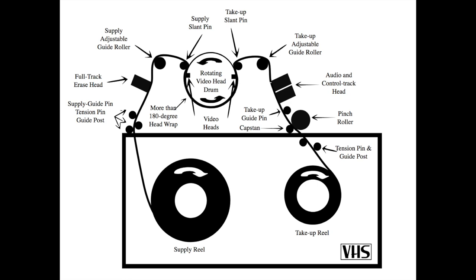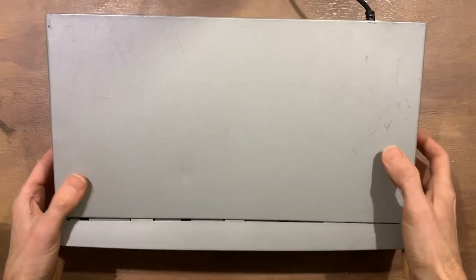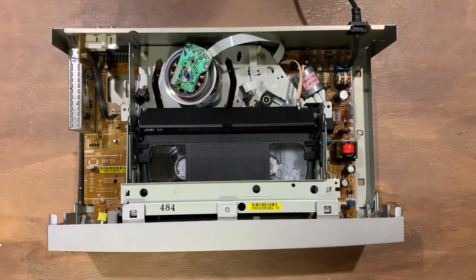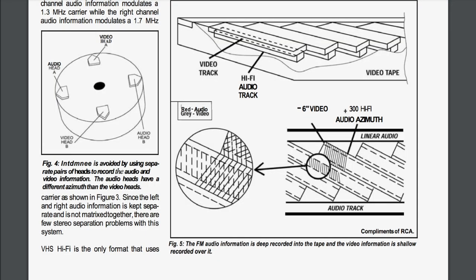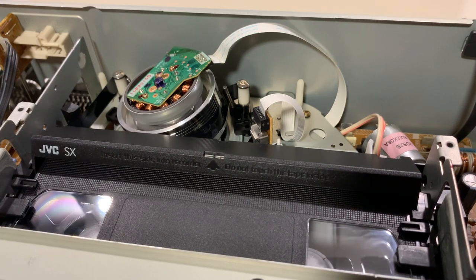Video tape works a bit differently though. It records an analogue frequency modulated signal on the tape alongside the video track. Let's open the unit up to see what's going on inside. You can see the tape path here, which goes around the drum and the recording heads. The audio is recorded in diagonal strips across the tape as the heads simultaneously rotate on a drum. The actual tape moves quite slowly, but the drum containing the heads spins at a really high rate. The more tape covered per second equals higher quality and less dropouts.